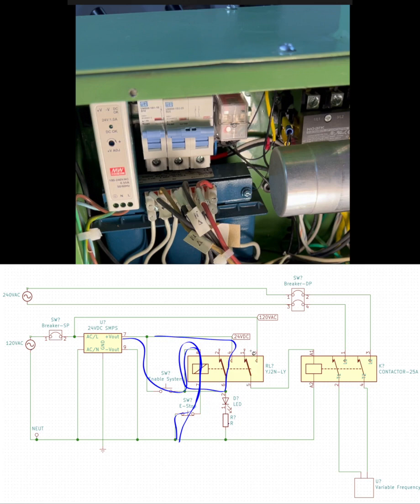The second pole of that 24-volt DC relay — the small one on the right side of the DIN rail to the right of that double-pole breaker — is feeding 120 volts into the contactor, which is just a double-pole, single-throw relay. In doing so, it energizes the contactor, and that's how we switch the 240-volt mains supply to the variable frequency drive.